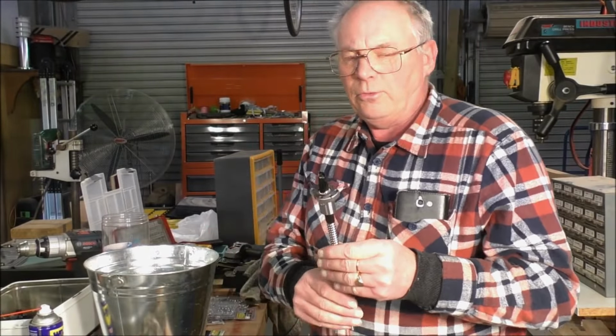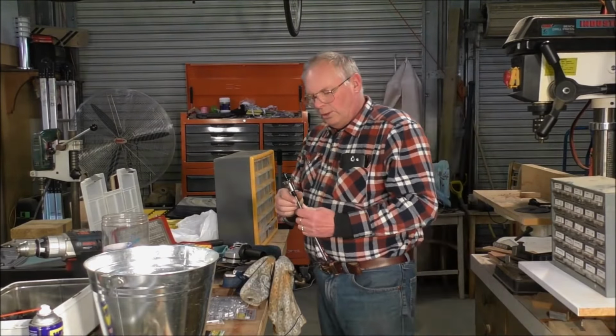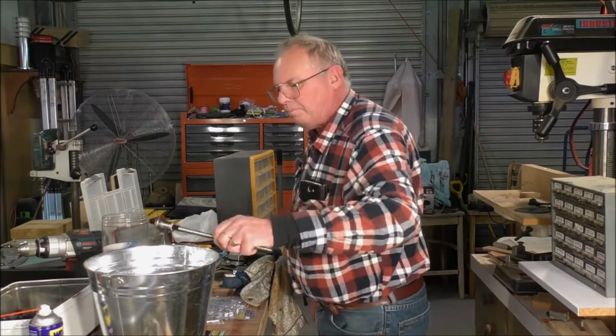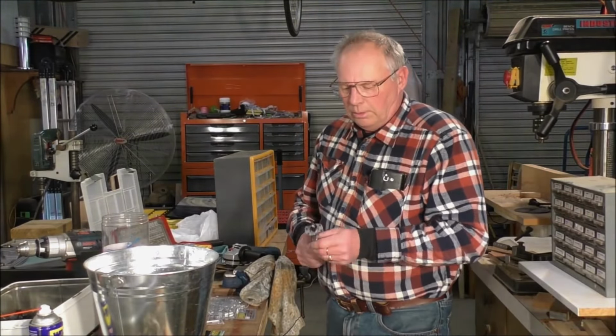So what I do is I grind a little bit, dunk it in the water. Grind a bit, dunk it in the water, so it doesn't build up too much heat. You've got to hold it by the actual ball nut body carefully. It takes a bit of time, but you will get there in the end. Just take your time, do it bit by bit, don't let much heat get into this, and you'll be fine.